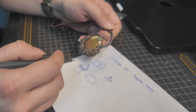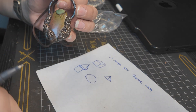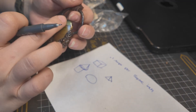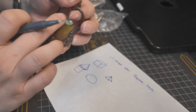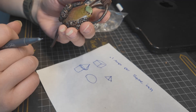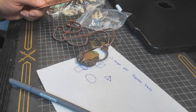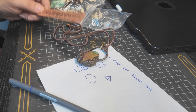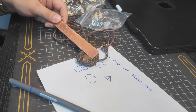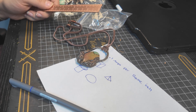My piece is already in the solution, so I'll give a quick example. For something a bit more complex, how would you calculate the amps per square inch? In this case, I'd do it almost as if it were a sphere and then a slightly smaller sphere on the inside. I would calculate this whole thing as a sphere and then a slightly smaller one, giving me a rough estimate. Let's take the ruler — it's about three inches, so 1.5-inch radius. Using a calculator, the area of the sphere overall would be 28. The inside portion at 1 inch gives 12 square inches. So 28 minus 12 gives me 16 square inches.